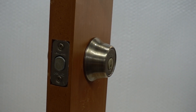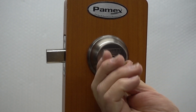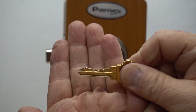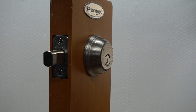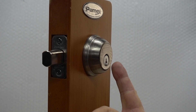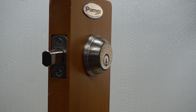This is often replaced by homeowners with the Schlage — a higher quality lock that does have security pins. This is the second most common lock found in North America, a Schlage 5-pin, found in many homes and businesses. These are better locks with tighter tolerances between the body and the core, usually spool pins as security pins, and a slightly paracentric keyway. So instead of going straight up and down, I may have to angle the needle a little bit to give it a direct shot at those pins.